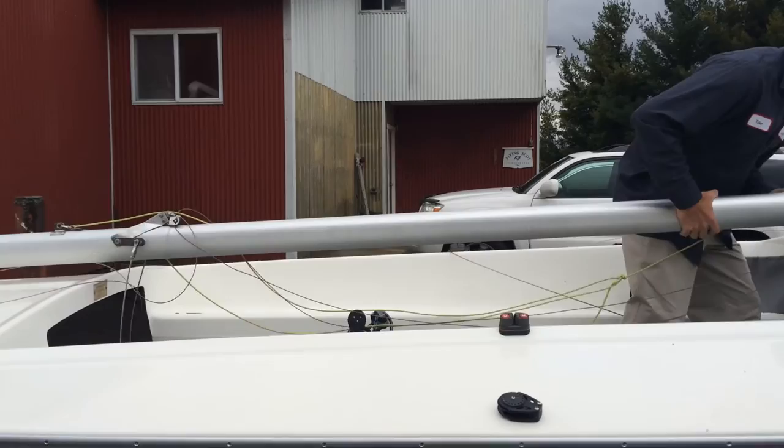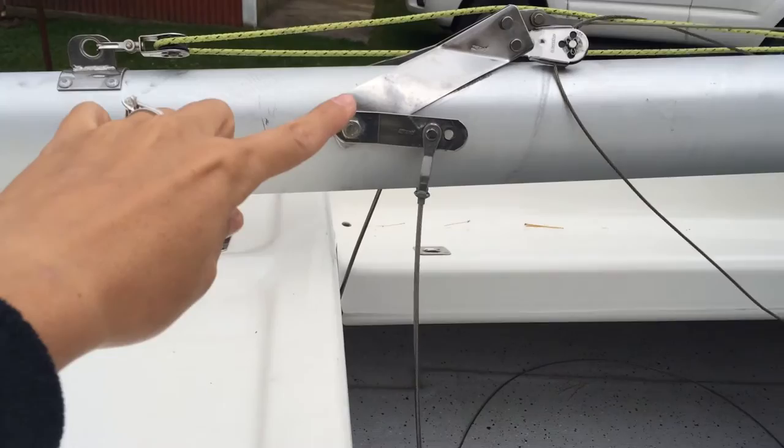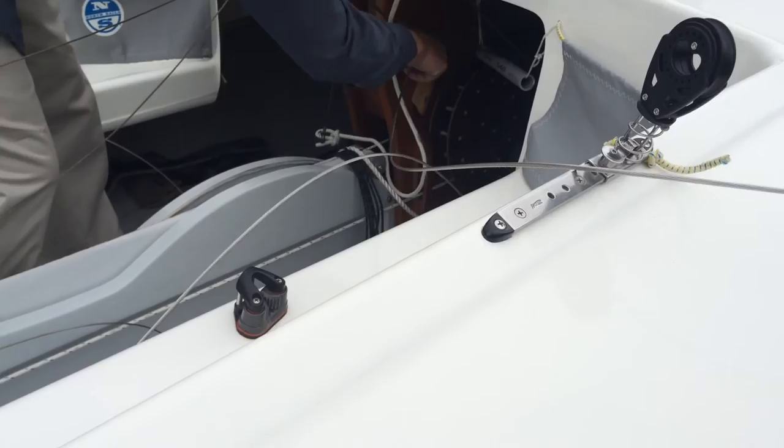So again, either the spacer or the ring on the mast — it doesn't matter. You just want to go ahead and secure that jib halyard shackle and tighten it so that it's not flopping around in the boat. The forestay, the sidestays — they all stay loose and slack in the boat. The spinnaker halyard, same thing. We pull the mast forward until that tang bolt is even with the aft coaming — that is our preferred position, as it leaves a minimal amount of mast sticking out the back.